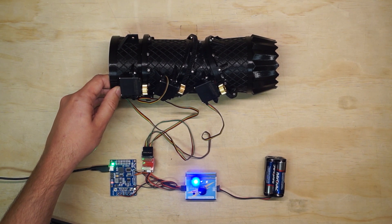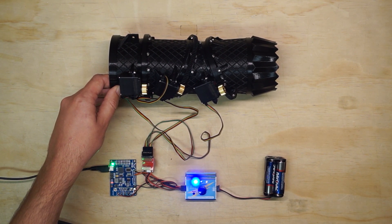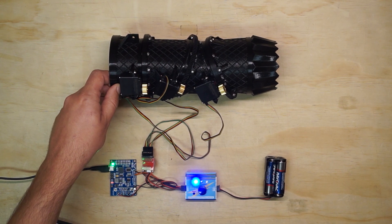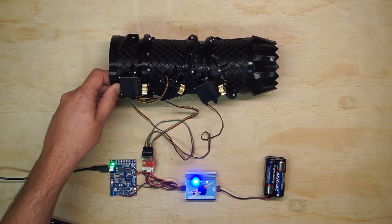The reason I've done that is that I was noticing the performance of those gear motors was getting pretty bad over time. The duct would run fine during bench testing, it would run fine during some flights, but shortly afterwards it would start sticking under thrust loads during transitions, and then after that it would even start sticking when on the ground with no load at all. So some pretty disappointing performance degradation from those.